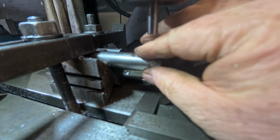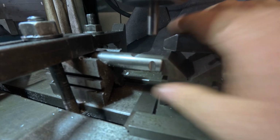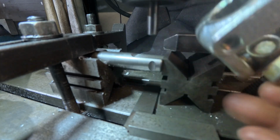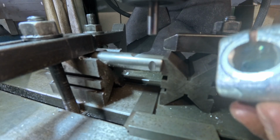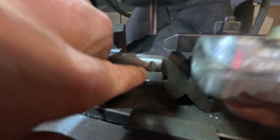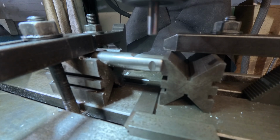We've changed the end mill to an 8mm because we're going to make this little divot. This I'll show you in a minute, but this fits in a fitting, and this is a bolt. A securing bolt goes through here. Many of you will have seen these. I'll just fetch one. So this is the fitting. The camera's in the way really, but basically we've got a double D on the end, which slides on, and then the bolt goes through here and it sort of traps it here. So if the bolt comes loose, this can't fall off, essentially, until the bolt's taken out.